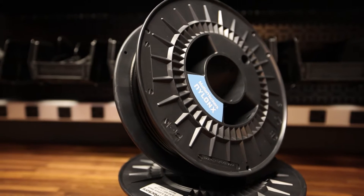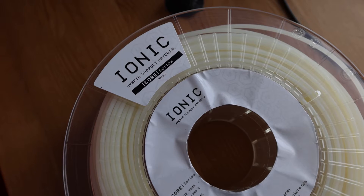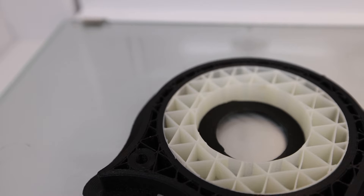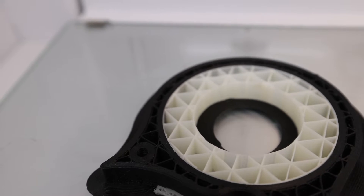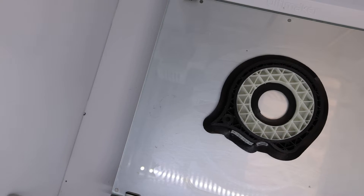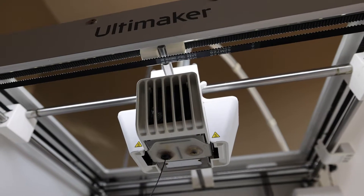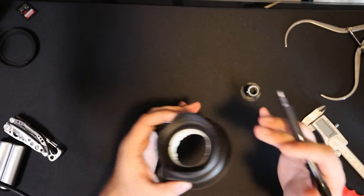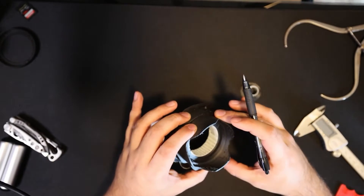Each of the gauge pods are being printed using Matterhacker's Nylon-X and Ionic filaments. Nylon-X is a combination of chopped carbon fiber with nylon, and Ionic is a high-temperature support material that dissolves in water. Learning to print with these materials wasn't coming easily though — I was really hoping the first print wouldn't look like this, because we have a lot of parts to print over the next few days.